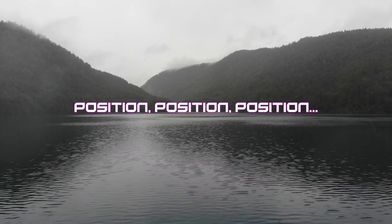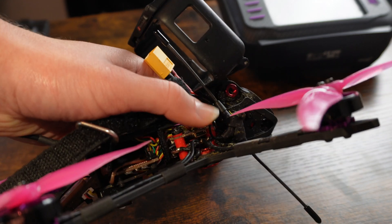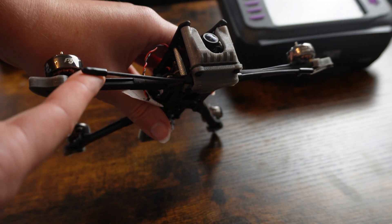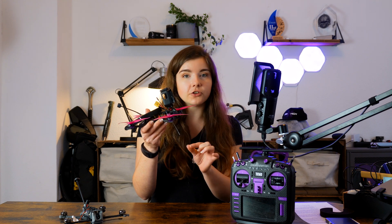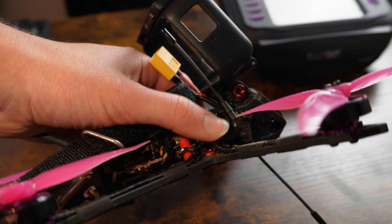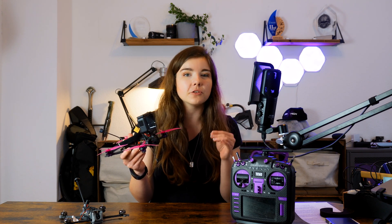Position, position, position. Did you know that your Crossfire antenna should stay as far away as possible from any type of electronics? I personally had no idea, so as you may imagine I didn't care — my antenna is actually next to the FC and ESC. The antenna's pole should also stay as far away as possible from conductors such as carbon. If you have just one antenna on your Crossfire, the best position is somewhere further away from carbon — as you can see in this close-up — and as far from electronics as possible.